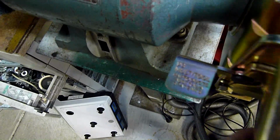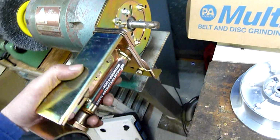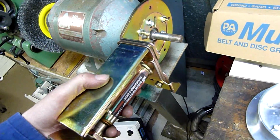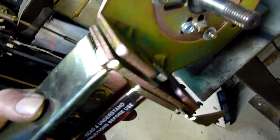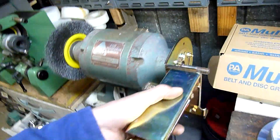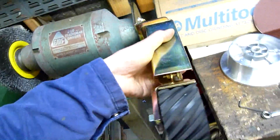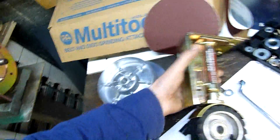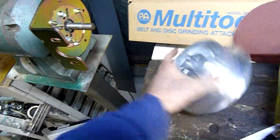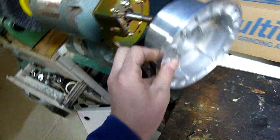Yeah, that's the camber adjustment lever. It rotates the front wheel left or right, or clockwise, counterclockwise, to keep the belt tracking straight. You can also loosen these 2 8mm bolts off a bit and also twist the front of the arm a little bit. So it's completely adjustable. It's not too bad, but yeah, it just takes a little bit of fiddling around to get it to run right, and then you're pretty much good.